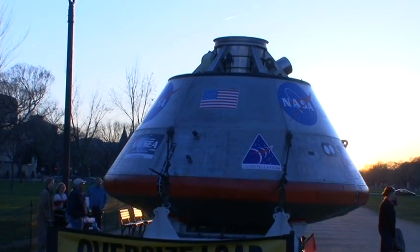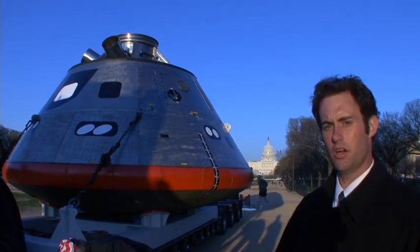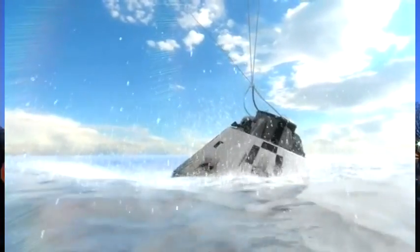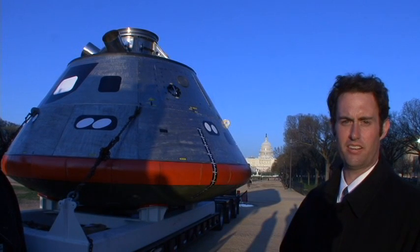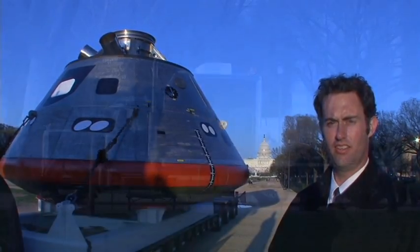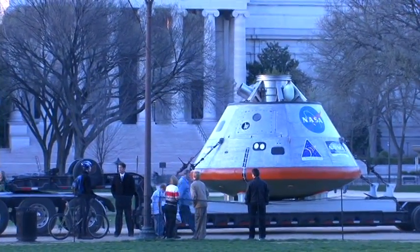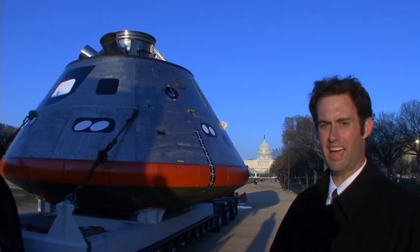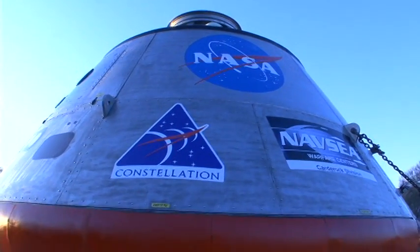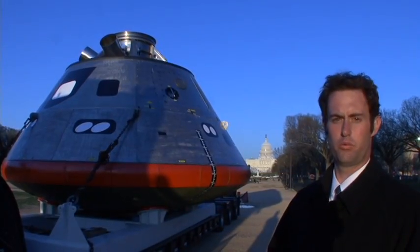This vehicle that you're looking at is actually a test vehicle. It will not fly. It was built so that we could test all the recovery procedures that we're going to need to do once this vehicle lands in the ocean after the missions are complete. This vehicle weighs right at 18,000 pounds right now. It was built out of 316L stainless steel. One of the reasons that we did that is we want this vehicle to be usable as a test article throughout the life cycle of the Constellation program. You can see there on the side panels some of the lower panels have screws in them so we can remove those side panels and move tankage around as the design shifts, as Orion matures towards a production design.